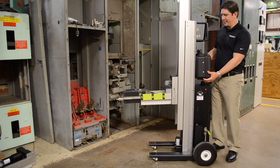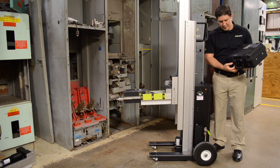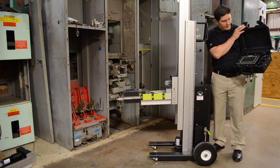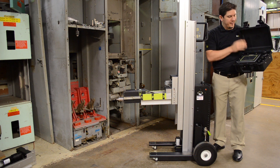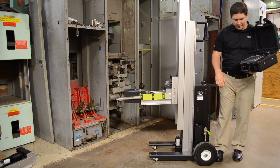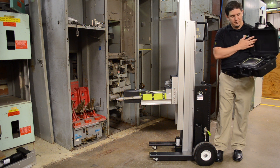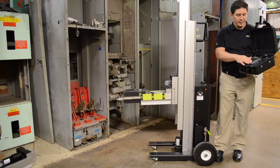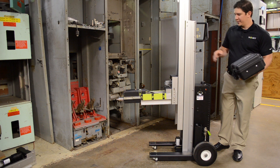This particular model has the wireless option added, so there's a wireless puck on the unit and we've mounted our remote touch screen in a little Pelican case — wireless. If you did have a failure with this, you take an Ethernet cable and go point to point, and you could still rack a breaker until you got anything resolved. There's a set of batteries in this as well that you've got to keep charged, as well as the base system.